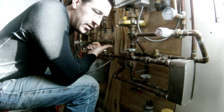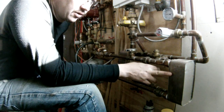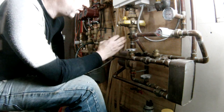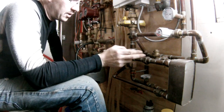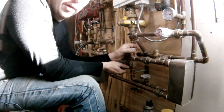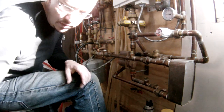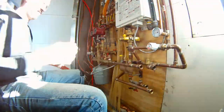Today we're going to be dismantling the heating system and redesigning it. This right here is a heat exchanger which allowed me to heat the heating system water with the hot water heater without having the waters mix. I wanted my fresh water going in and coming out and my heating system to be separate. Now I want my tankless hot water heater to heat directly to my floors, so that's what I'm going to do.